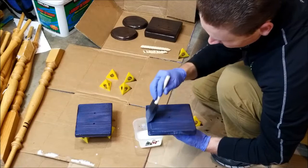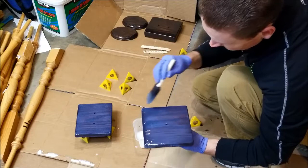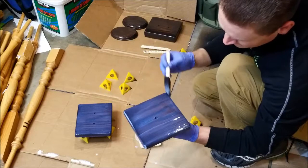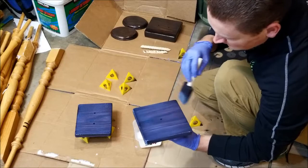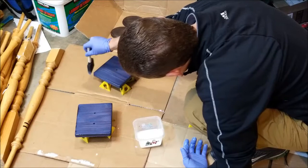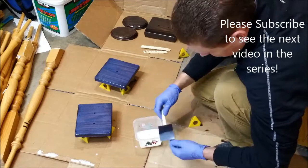This is a semi-gloss polyurethane — I kind of like the glossy look on the railing, so I use semi-gloss here and on the floor. Now just going around the sides to make sure they look good, then get the top nicely and evenly coated, eliminating any areas with big blobs. Since the top caps will get a lot of traffic and wear, I might put one final fifth coat on, since this is the fourth coat I've done.